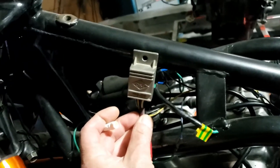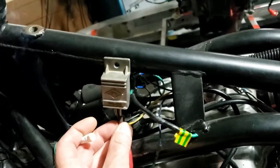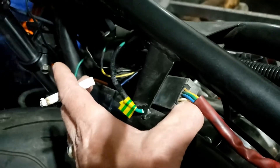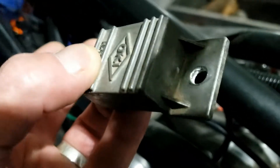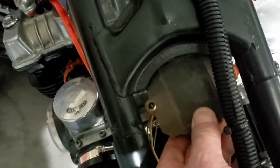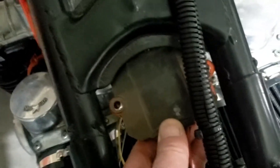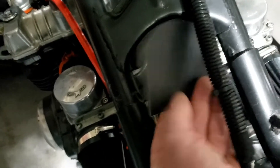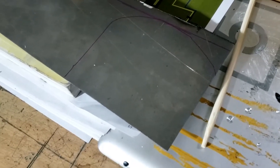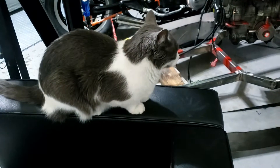While it was a neat idea, we'll put them elsewhere. This other guy had them randomly mounted on the frame next to each other, which is all well and good, but if I can I'm going to tuck them in there because I think that would be neater - might have to modify them slightly, take those little strengthening brackets out. That's plan D, E, or F I think. The regulator I think will fit nicely there, upside down. We need something for it to attach to - starting with a cardboard cutout, we've translated it to metal and need to cut that out now.